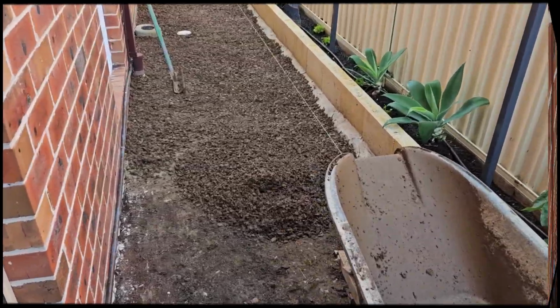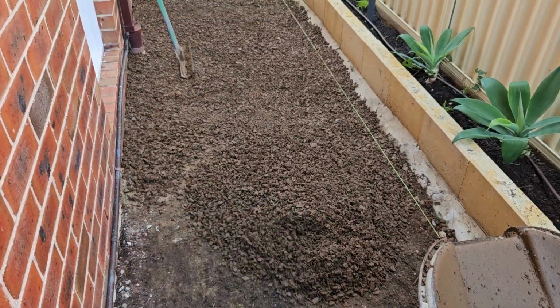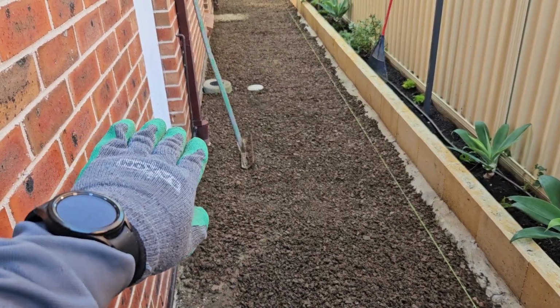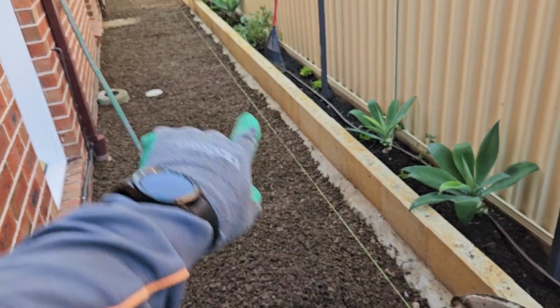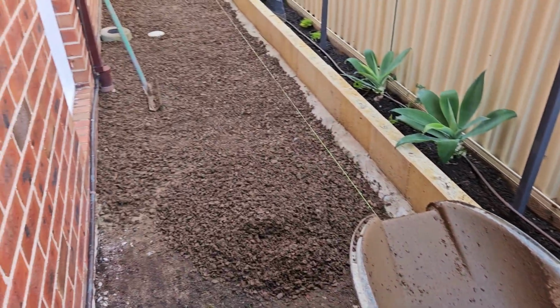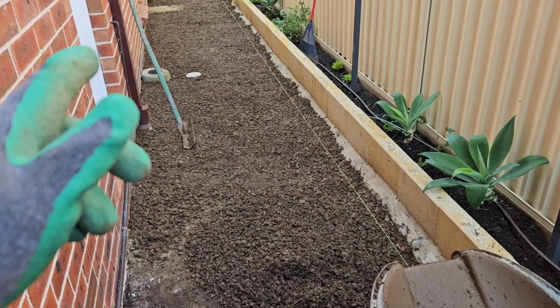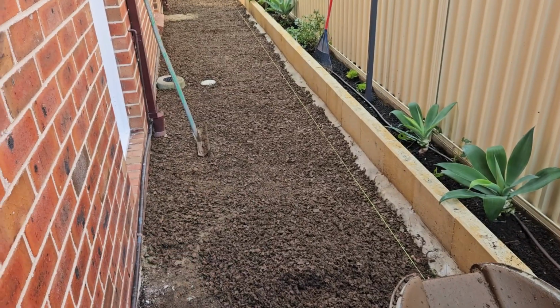Okay, morning guys, this is the next level. We start to laying the road base, leveling by the line, a slope coming from the house slab, concrete slab to the side, and then from the top going out of the pathway. First we need to lay the road base, level it, then spray some water and do it compacted by the small compactor.